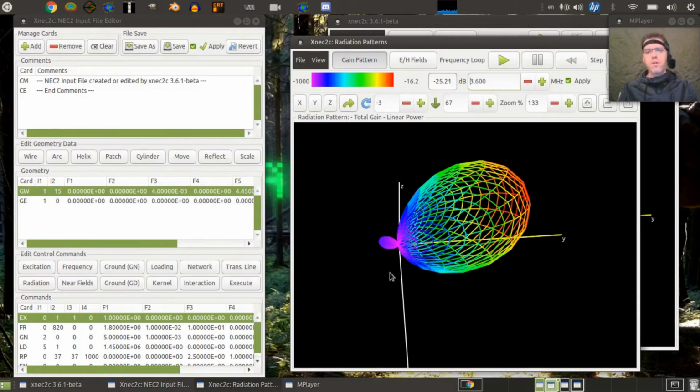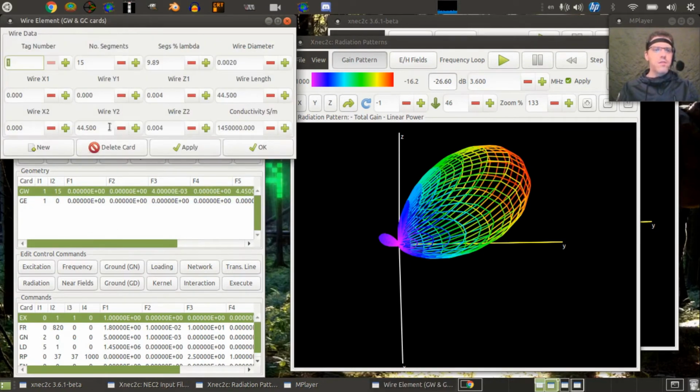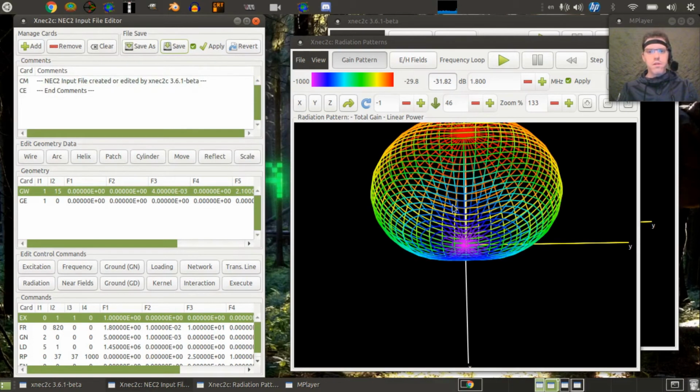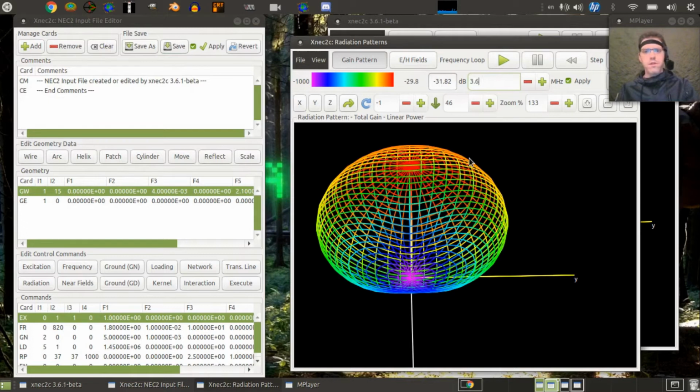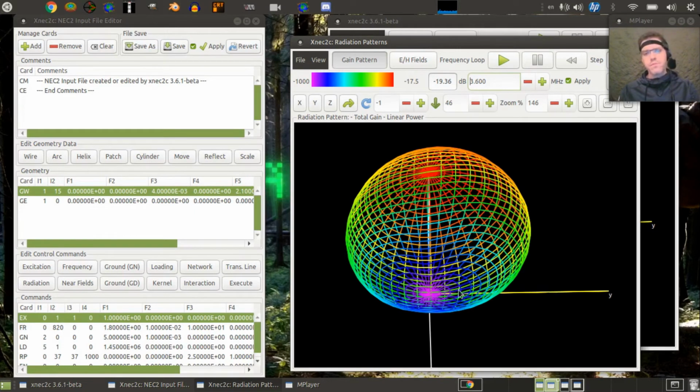Let's say that we want to use the same type of antenna wire, and we just want to cut it somewhere. So we shorten the antenna so it's more appropriate for near vertical incidence skywave. Then we can just introduce a link in it. 21 meters is a pretty standard length of random wire, I think. You get a pretty good standing wave ratio in a coax with a 9:1 transformer with a 21 meter long antenna, I believe, on the amateur radio bands.